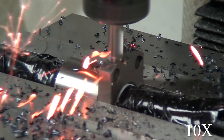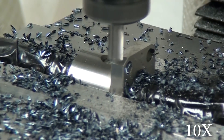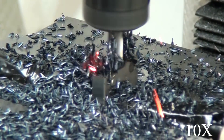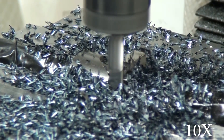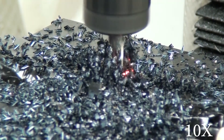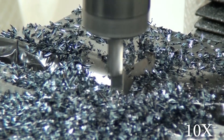Let's go over to the mill and show you how not to machine hardened steel. I've clearly got my RPM set way too high. What I settled on was about 1,000 RPM and 2.5 inches per minute, with a quarter-inch four-flute carbide end mill. You might do better with a really nice name-brand end mill — I buy the cheapos and I did trash this end mill by the end of the project, but it was only about 13 bucks.